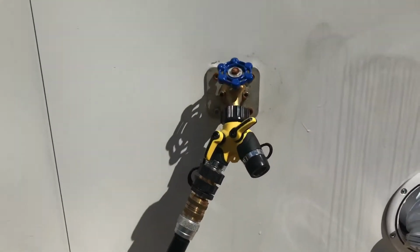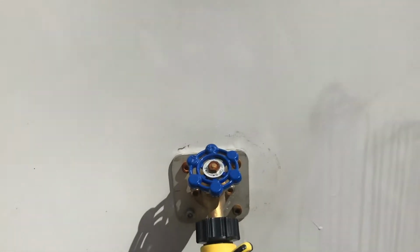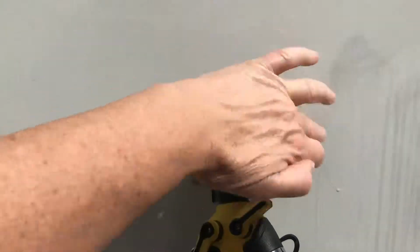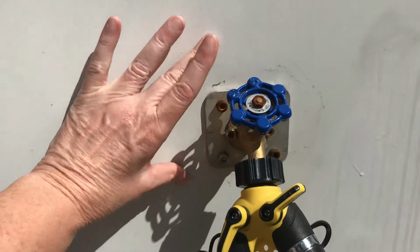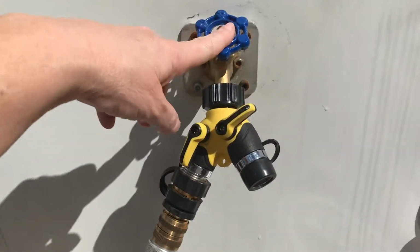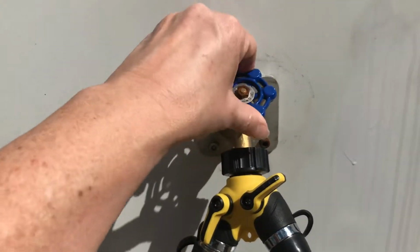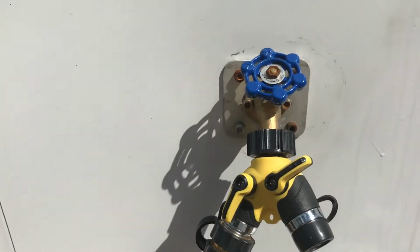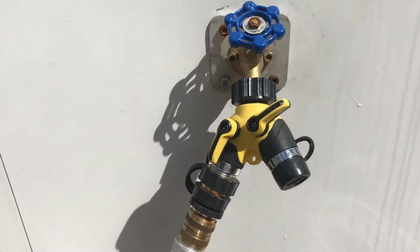So you can see here we have an aluminum trailer. So it's aluminum, and on the inside is plywood, and in between there's just an empty space. So when Chuck did this, he built, you can't see it, but he's got reinforcements inside here to help support it. So this is our water in. We got one with just a spigot, so for an emergency we can shut it off here if we need to. In case we turn it on one day and the pipe bursts or something like that, or a hose bursts, we can just run out here and turn it off.